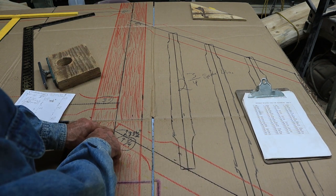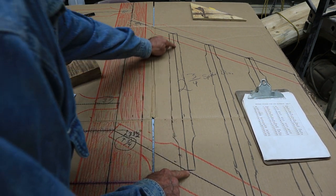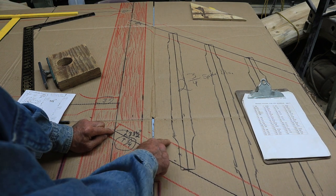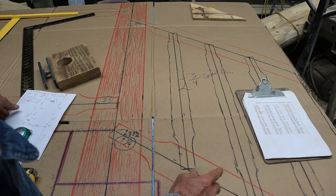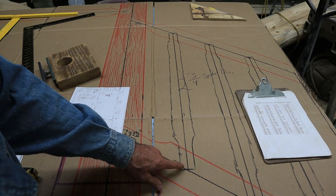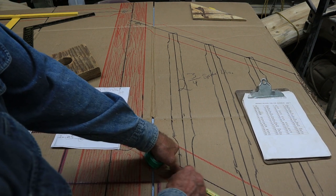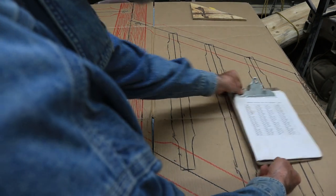But when you go from middle to middle, from the exact center, then come up the exact center, and then up the exact center, this from here to here is exactly the same as from here to here, even though it looks really different. Now, each of our rail sections on the stairway is 50 3/4, and we want to maintain a space like, oh, we've got maybe 8 inches here to work with, right? From center to center to end up with 4 inches. But we've got to get things even all the way along.